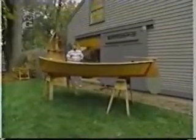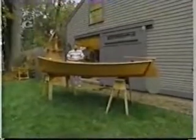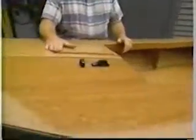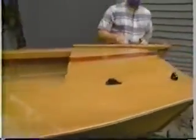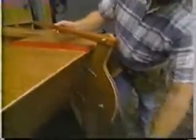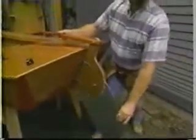Maybe we should call this the New Yankee Boat Yard. Looks pretty salty, doesn't it? For the last week, I've been putting the finishing touches on this sailing dinghy known as a Clancy. I installed the deck, the deck trim, and then covered everything with three coats of epoxy. I varnished the wood that I wanted to show and painted the underside. I've even installed some of the running hardware. I formed a tiller and a rudder assembly, and it's just about ready to take it for a sail.